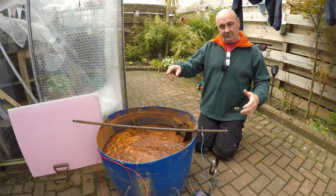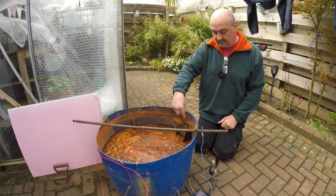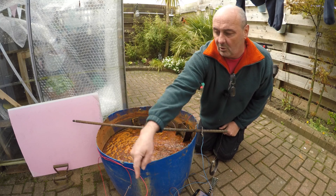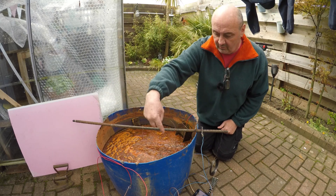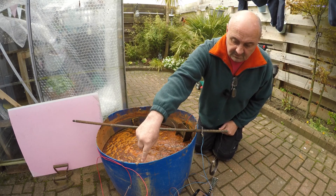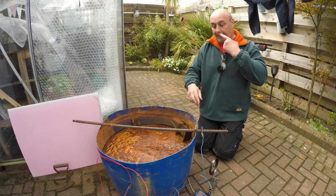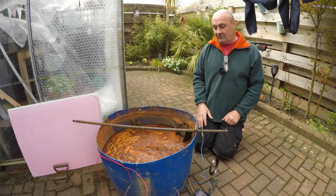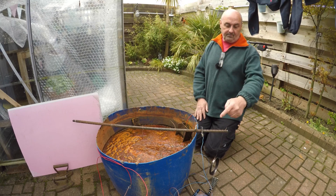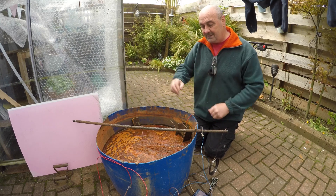As you can see, I've changed the setup a little bit. I've got a much bigger main anode in here, and I have two more sacrificial anodes wired up on a loop, so we've got a big circle going around the components now. You've still got your positive lead to your sacrificial anodes and your negative lead to this rail. I've wire-brushed this rail to give it clean contact, clipped onto there, and I've got the parts suspended in the bath.